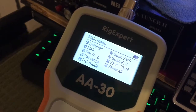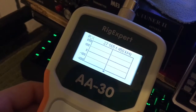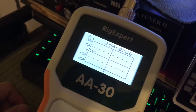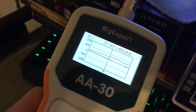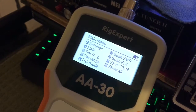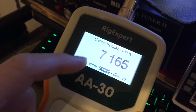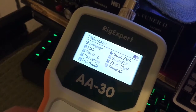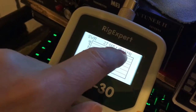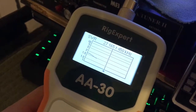These have a lot of nice features — scan the RX. But for the normal person who just wants to check their antenna, it's very simple. Turn it on, hit 2 to set frequency, hit the check mark OK. Then number 4 — scan SWR — and set how high up you want it to go.